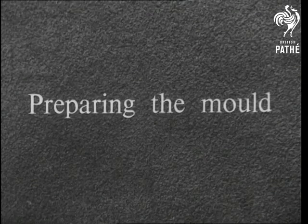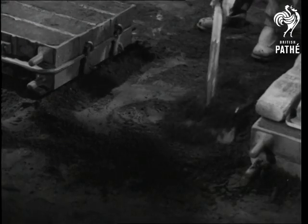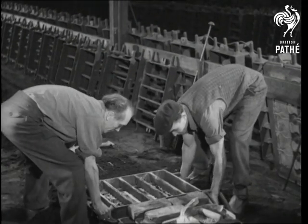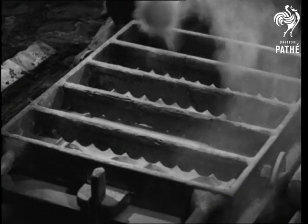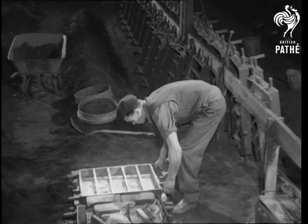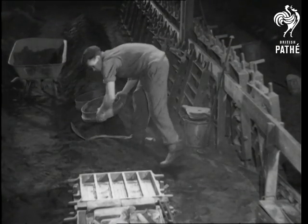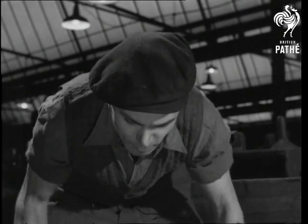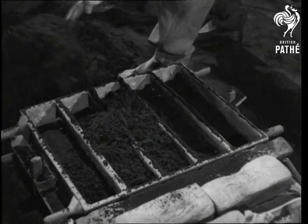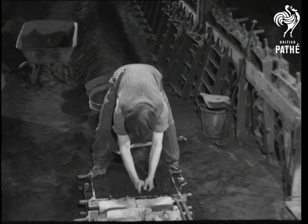The next actual stage is preparing the mould. Pattern plates to make two cooker hotplates are being used. This man is smoothing floor sand to make a firm bed for an iron box which contains a pattern plate. The top half of the box has already been packed with sand. Onto the pattern plate, first, parting powder is dusted. This prevents sand from sticking to the pattern when it is removed later. Next comes finely sieved facing sand. This prevents coarse sand from causing lumps or hollows in the casting. Ordinary moulding sand is now shovelled into the box and carefully tucked in by hand. This makes the sand fit closely to the pattern plate.